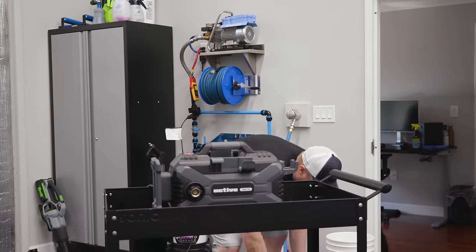Okay, so we've already done this testing, so I'm going to cheat this step a little bit here. But we have a 40 degree 4.0 nozzle. I believe it's a 4.0. You can usually tell from the side. So this says 40040. That means 40 degree 4.0 nozzle, the first zero, because it could be like a 10.0 nozzle. We've already tested this out to figure out which gives us the appropriate pressure, and then we get a flow reading from there. And so when I run this,